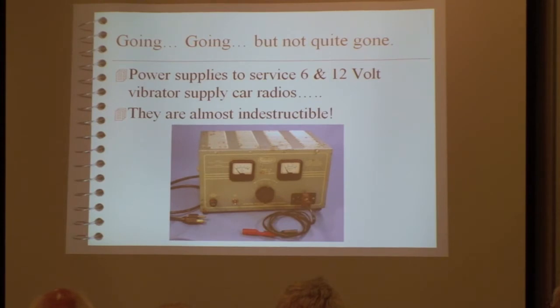At the flea market this morning at 6:30 there was a 6-volt, 12-volt power supply for five bucks. That's the one I use mostly — just a transformer with a few taps, some copper oxide rectifiers, and it could care less if you dead-short it. I don't think I've ever even blown a fuse. You don't need an exotic supply.